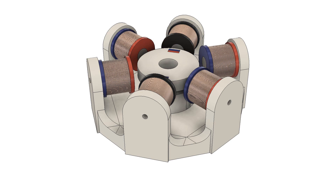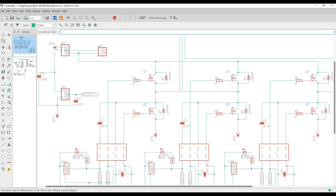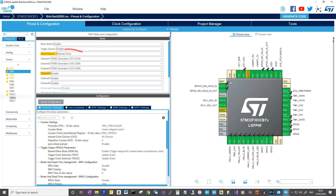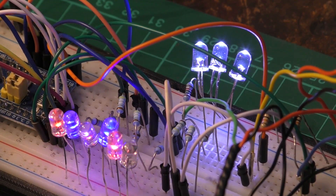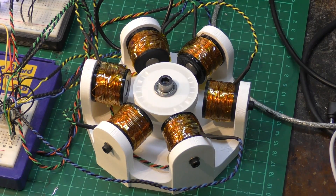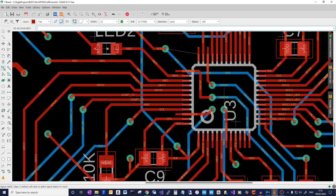To have any chance of making this work, you're certainly not going to get away with just a reed switch and a magnet anymore. You need to pick your favourite microcontroller, design some electronics so it can switch the field coils on and off, and then do a bit of head scratching to come up with a commutation table, which you implement in software, switch it all on and see what happens. At this stage you end up with a breadboard prototype — it works alright actually, but someone only has to slam a door in the opposite room and a wire pops out and you're tearing your hair out. So what I'd like to do next is lay out a PCB, get that sent off to be professionally made, and whilst waiting for that you can get on with some other part of the project.